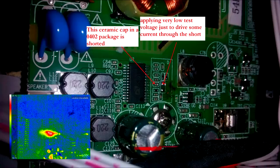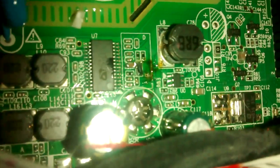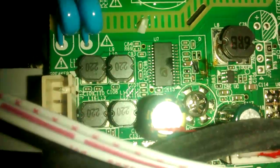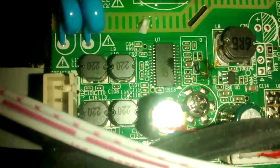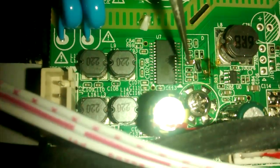Here in this case it's the ceramic capacitor — the bypass capacitor near the IC. I removed it. Since this capacitor is shorted, I don't know what its value was, but I'm guessing it may be the same as in the application note or datasheet. So I assume it's 1uF.